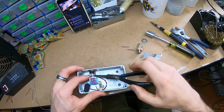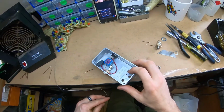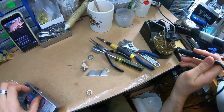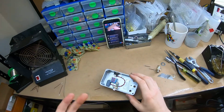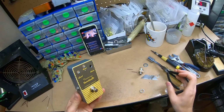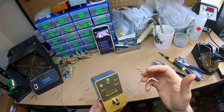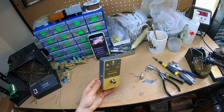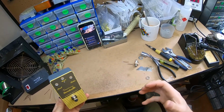Most of my pedals are this 1590B arrangement, just because it's easy for me to build and it's familiar. So it empowers me to experiment and get new builds out there quicker and work on the mods rather than a new layout. Plus I just like the smaller builds. I can hold it in my hand and it's lighter. Once you get the top mount jacks, you usually need a bigger enclosure. It's heavier to post, it uses more materials, and this is compact. It fits. I understand on the board it might need some more jack space, etc.